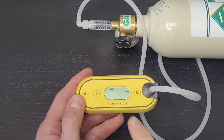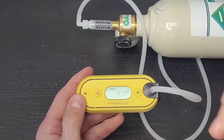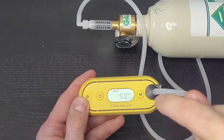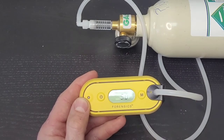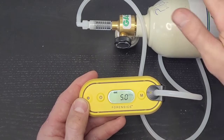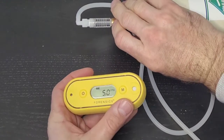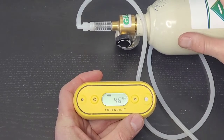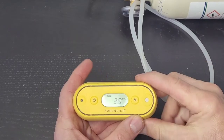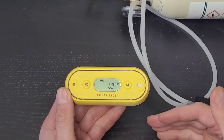After 60 seconds, the concentration has stabilized to 4.1 parts per million. We know there's 5 ppm being exposed — it's showing 4.1, so it's off by 0.9 ppm. We hold down the M button and tell it that is 5 ppm — that's what we calibrate to. It enables that reading, and now it's reading 5 ppm, accurate to this NIST traceable gas source. Calibration is done. Turn off the gas — please do this in a ventilated space any time you're calibrating. As it's exposed to fresh air, it comes back to our zero baseline. That's how you perform zero and span calibration.